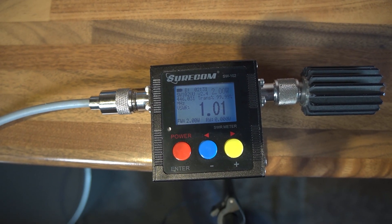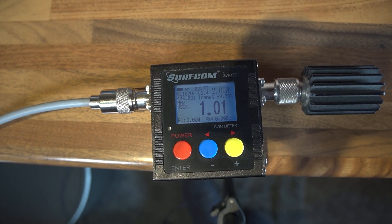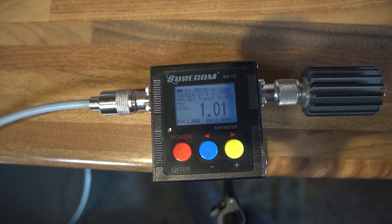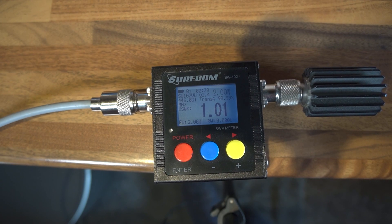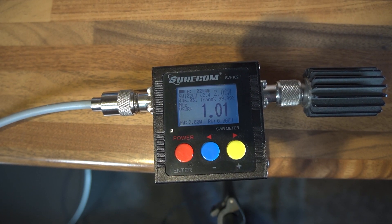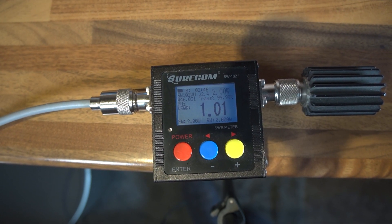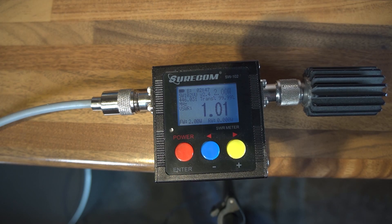It's the first time I've actually seen that on a radio where it doesn't detect on the meter, which is quite interesting. For most people, I think you'd probably want to run it at the mid power level if you're using it for amateur radio, and maybe on PMR446 mode run the low power to make it the equivalent of just over half a watt - though I'm only guessing, because I can't measure it that far down on this particular meter.